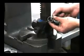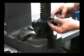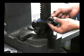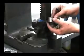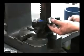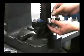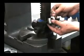If the pump is left with chemical in it for a long period of time, you may get pitting inside of this sleeve, and that will cause a leak even with a new seal. Check this O-ring — it's also included in the repair kit — and make sure that this brass ring is in good condition.